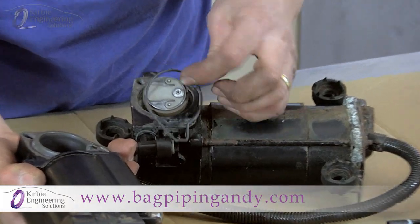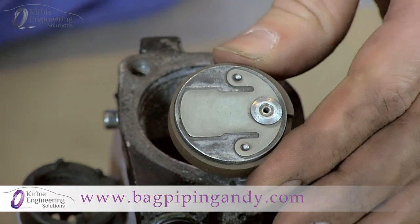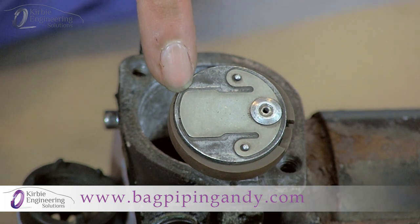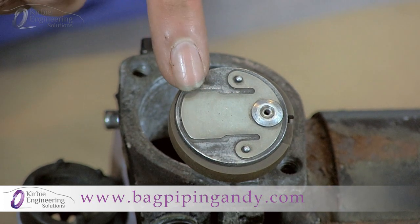Note the rubber O-ring and its position. This is the piston ring we're going to change. Have a look at the air intake vane on top of the piston — make sure it looks closed. If it's bent open it will reduce performance, so make sure that's closed.